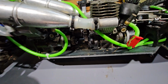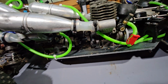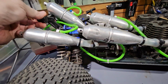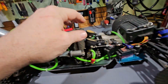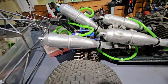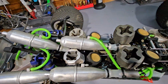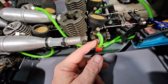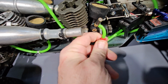And this is kind of tricky too, because of the way these motors mount, it's not really meant to slide. It's meant to just bolt right in unless you cut slots in there. Then again, for the extra weight, we're running dual springs in the rear here, and then just singles in the front, because it does carry a little ass heavy. We've got the rears with independent fuel systems, and then the front has one common shared tank, and then I use these fuel cutoffs to regulate one or the other.